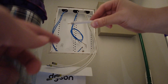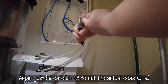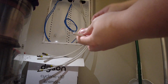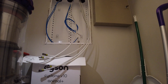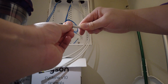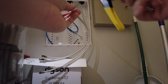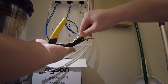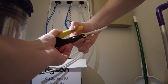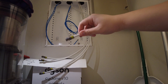I'll use a knife to trim it a bit more so the center conductor is pronounced. Then twist off the outer jacket — there's a nice clean coax exposed. Take one of the crimp ends, slide the cable through so the center conductor pokes out, place it in the crimper, make sure it's snug, apply pressure until the crimp seats fully, and there you have a finished coax cable — stripped, end on, and crimped.